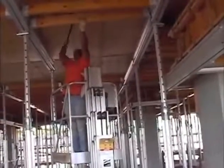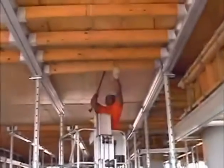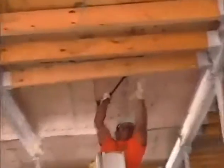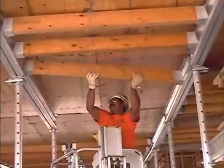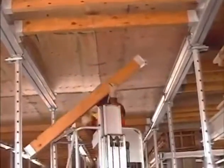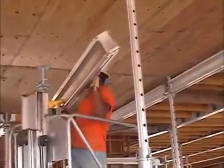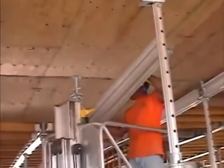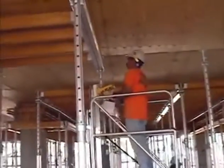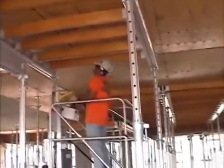The plywood joint has nails holding the plywood in place and must be pried down. The joists only weigh 20 pounds each, so one man can easily handle all of these units. That's the last joist, and now the workman is removing the aluminum ledger. This ledger weighs 48 pounds and again can be easily handled by one man. He is now moving to the next bay and will continue the process.